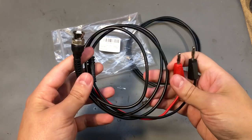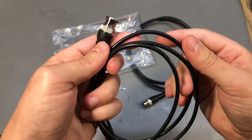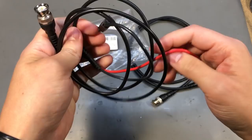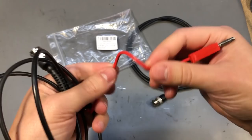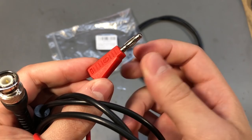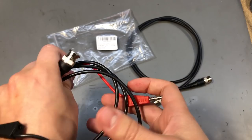I also got this model which is a BNC to 4mm banana jack cable. This can be useful if you plan to do some measurements on a power supply — you would use this to connect the scope directly to the output of the power supply. I'm not really sure this is truly RG58 or RG59 shielded wire inside, but the build quality seems very decent. These wires are PVC but likely the softest PVC wires I have seen — really flexible. The banana jacks have this nasty design where the crown spins freely, so I'll probably replace them with higher quality ones, but otherwise I quite like the construction.